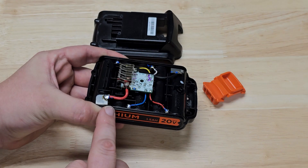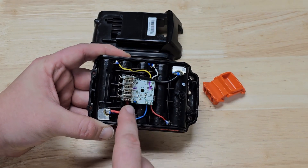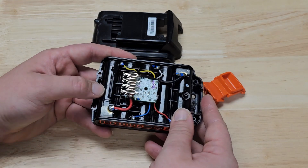These are our main power connections. As you can see, they go directly to the outputs. There is nothing between this. This is not a battery management system. This is just a monitor board for the charger, and we may get into that in a later video.